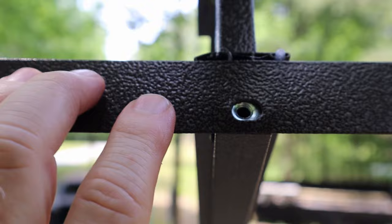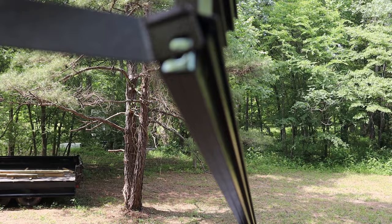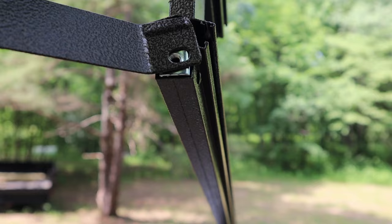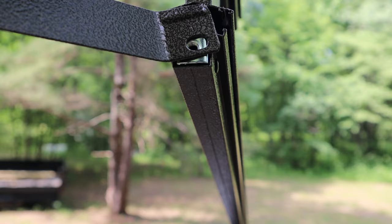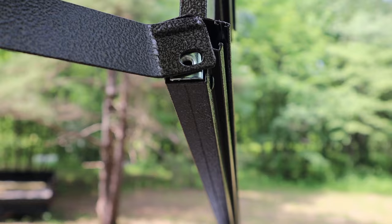So now everything is going to end up lining up here, here, and then here once you get the other screws. Now, we're only going to put in these corner screws temporarily because we have to put center caps on them. So this is just simply enough to hold them there in place until we end up getting the long span of the roof support braces in, which will be G6.